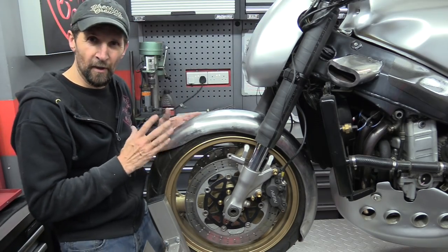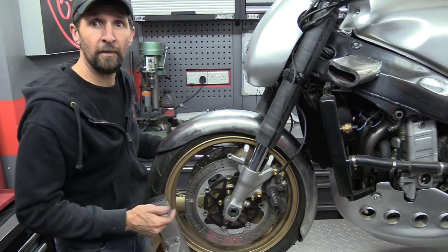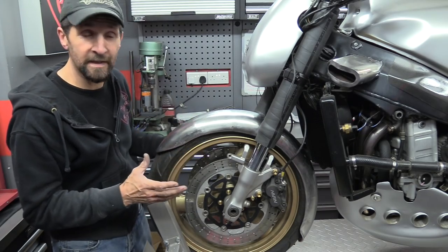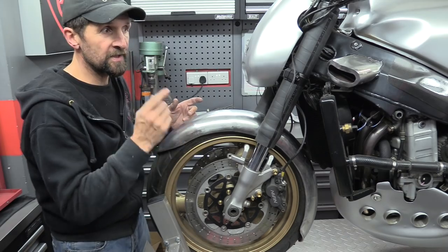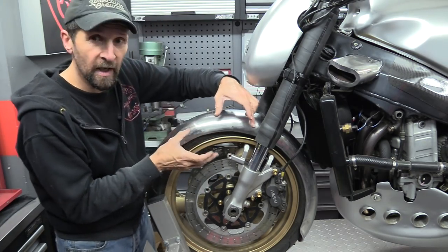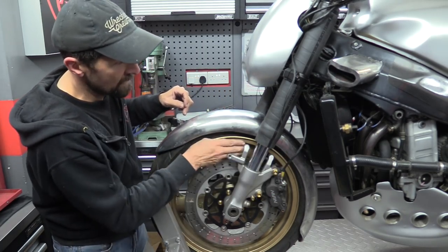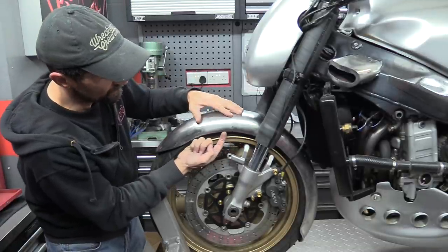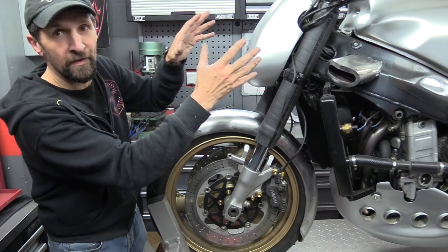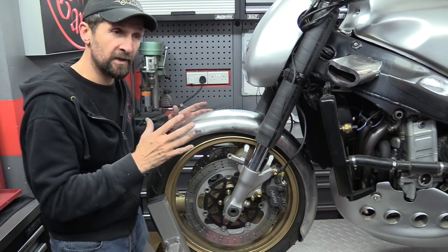It kind of picks up the front of the mudguard - high-boost Blackbird, that sort of thing. Definitely like the depth at the front, and then you might as well emulate that at the rear as well - take it right the way down. All I'm going to need after this is some bracketry to hold it together. I'm thinking 3mm - the stuff I made the top of the benches from. I'm thinking of making a plate, cut it out in cardboard, that bolts to there front and rear. Seam weld it along the edge so it comes up as one piece, and the mudguard can then be blended in. Perhaps some holes bored in it - big ones for looks and to take some of the weight out.